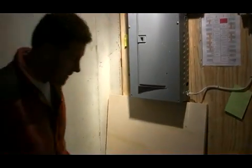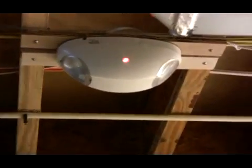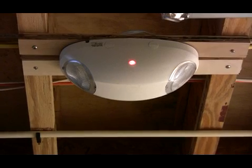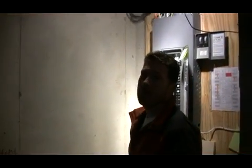The other thing I thought was a really good idea — I saw it online where a guy had installed a transfer switch and took the additional step of putting in an emergency light. I bought this one from Lowe's, and it has a battery inside so it's always charging. In the event of a power outage, it comes on automatically. I positioned it so that one side shines on the panel itself and the other side illuminates the way down to the panel. I'll demonstrate: turn the breaker off — it comes on. Turn the breaker back on — and it goes out. I like that feature; it was inexpensive with a lot of benefit.